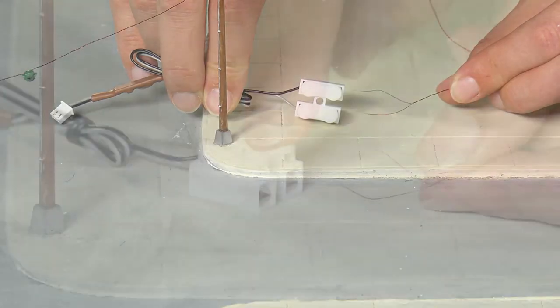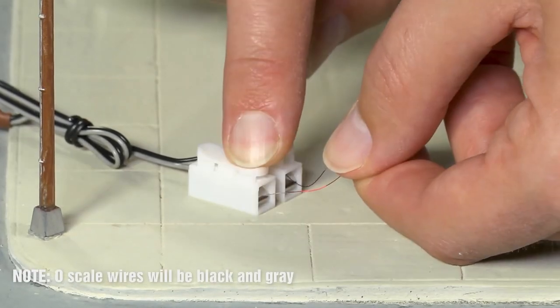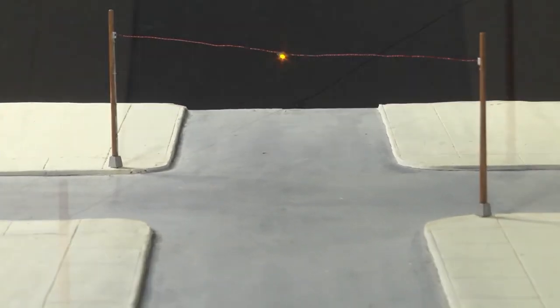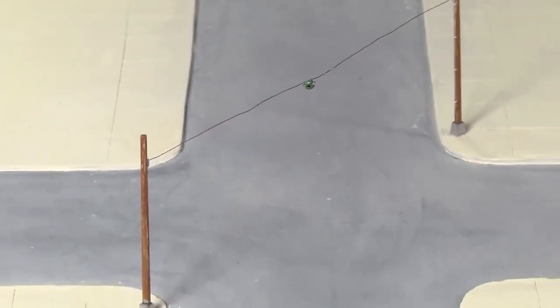Next, press the button on the linker plug to connect the black wire on the side where the black wire is attached. Now insert the red wire. Insert the plug into the Just Plug light hub port and connect to the power supply. If desired, color the wire with a black permanent marker.